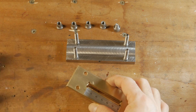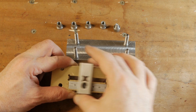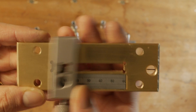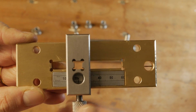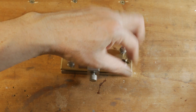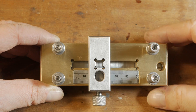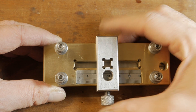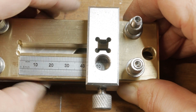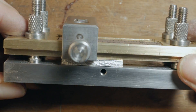I concentrated on the surface finish because I wanted to obtain an appearance similar to that of a measuring instrument. I also made the couplings hoping that the precision would also be reflected in the punching. I found it very convenient to be able to insert the pieces and then tighten them with the knurled nuts. Being four nuts, you need to pay a minimum of attention so as not to position the piece un-horizontally. As you can see from above before punching, the cursor has the zero along the metric line very clearly, and once the pitch has been set, just tighten the knurled nut.